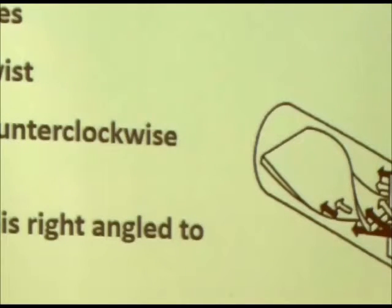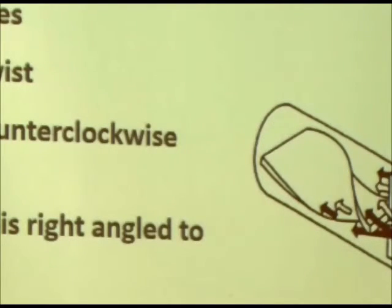There are helical elements inside the static mixer. These helical elements are short sections, twisted approximately 180 degrees, that are used to actually mix the fluid together, whether it's two fluids or multiple fluids. They are placed in series with one another as you go from the beginning of the static mixer to the end. The trailing edge of one element and the leading edge of another element are placed at a 90-degree angle to one another. This helps with the mixing process altogether.